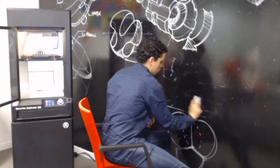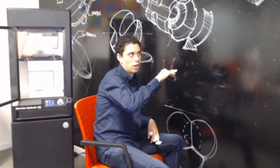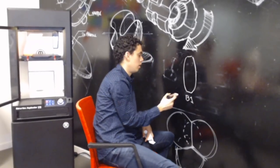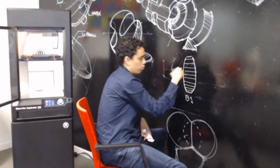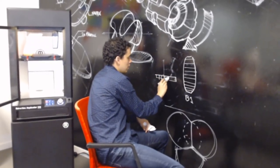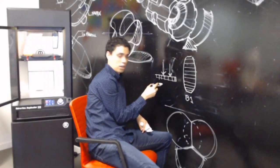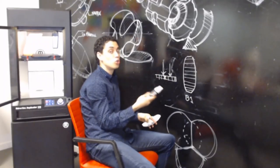But the other thing that I wanted to touch on was the layer addition. That's talking about how the plastic is laid on top of each other when talking about the layers. So let's think about the two possibilities. Here I have my first board that's completely oriented vertically on the z-axis, so each layer would be basically like a cake, placed on top of one another. The challenge with this one is that as soon as I turn the board on its side, all of the layers are going to be lined up parallel to my weights, to the perpendicular force. Let me know if you guys can see this properly, I know it's a little bit small. But as I apply the forces, the force on the layers, at the contact points with the layers, is going to be really big.